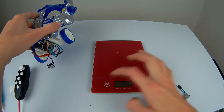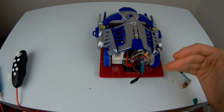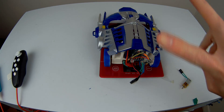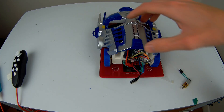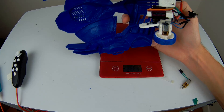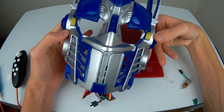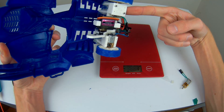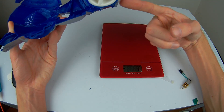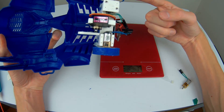So let's just do that real quick. I'll turn this guy off so the servo stops jittering around. Hopefully we can get this scale to power up. Yeah... 150 grams. That is not good because that means I don't have enough weight to put a backing plate on here, which means I can't actually turn this into a legitimate combat robot. I have two problems: one, I can't protect the battery properly — I can literally just poke that — and also I can't put a long enough arm on this thing to have it actually grip anything. I think this is actually the first Will It Bot that's going to fail because Optimus Prime's mask is just too heavy. This is the craziest, lightest robot chassis I have ever 3D printed and it's not enough. I could probably drop back to 6mm wheels, but that's not going to save me enough weight.